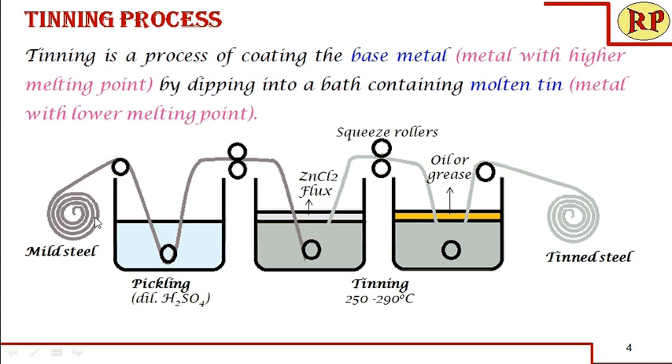Here we have a pre-treated continuous sheet of mild steel. When we say pre-treated, there is a series of pre-treatment methods already applied, but during storage there can be development of scales or oxides over the pre-treated sheet. So we will have to remove those scales or oxides, and this is done by passing through the pickling bath which contains dilute acid — dilute sulfuric acid or dilute HCl — where the scales and oxides are removed, and then it passes through the tinning bath.